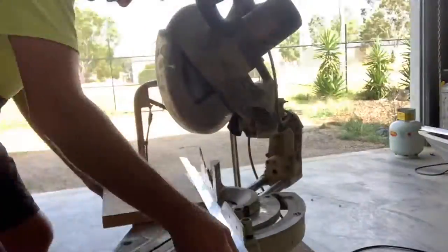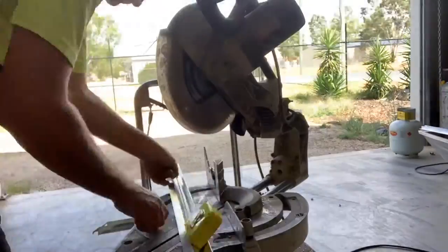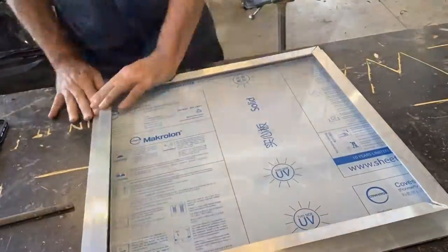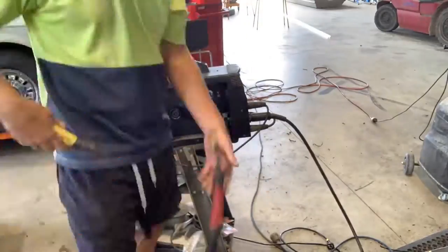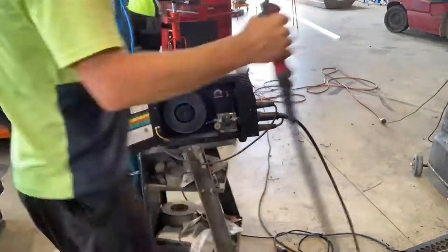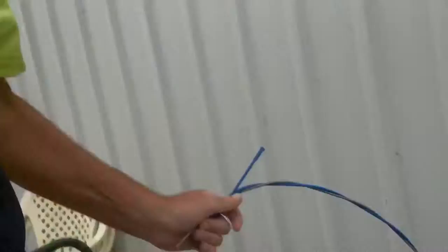This could be interesting for anyone who's never welded aluminium. But for all those welders out there who've been waiting for me to fail - it did fail. I had the rollers too tight and it squashed the aluminium and it got stuck in the liner. But you all knew that. So anyway, new liner - this time I'm going teflon. And of course I had to buy a new steel one because I've got aluminium stuck up it. Hope you learned something.